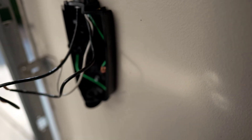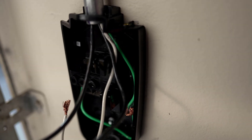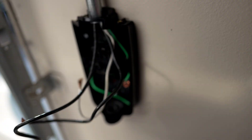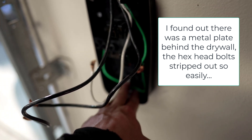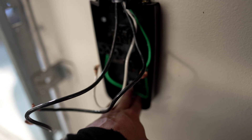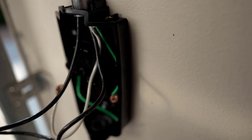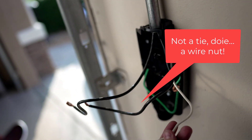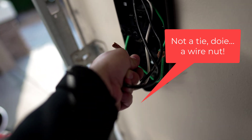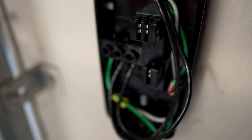So what do we need to do differently to install this? Essentially, take the old box off and install this new plastic box from Tesla. You'll probably need new hardware — I couldn't get through the wall with the standard hardware. If you're just screwing into wood it'll be fine, but if you're screwing into anything else you'll need new hardware. We're going to need both the hots and the ground, but we're not going to need the common — we'll just put a wire tie on that. The two hots will go in line one and line two. Now that the wires are installed, you can see the order again: you don't need the common one, and we'll probably end up electrical-taping that wire.